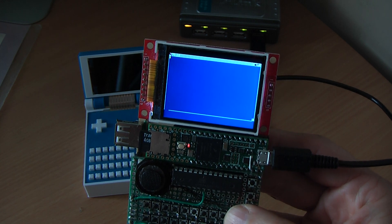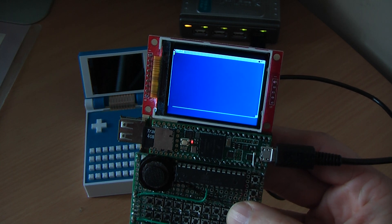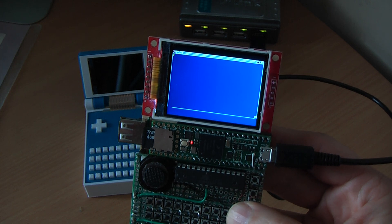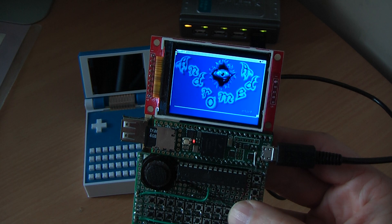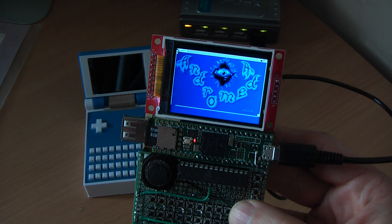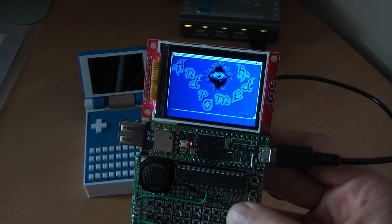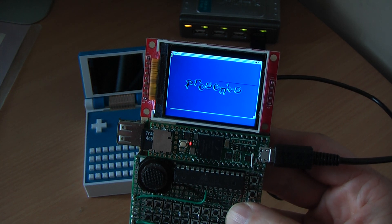Let's try a few experiments putting also the image of the disk into the PS-RAM. For the moment it emulates 2MB of chip RAM and 4MB of fast RAM. So I thought I could store two extra floppies into the RAM and have a kind of swap feature for multi-disc systems. But I had some issues when it copies from PS-RAM to PS-RAM — it's becoming very very slow for some reason. I didn't investigate really what the problem was.